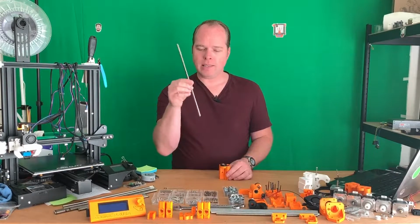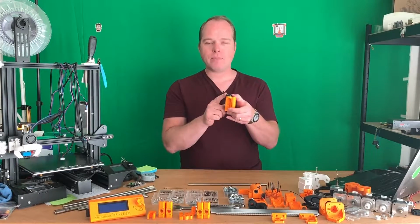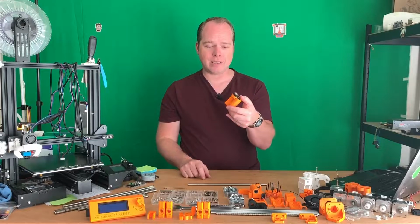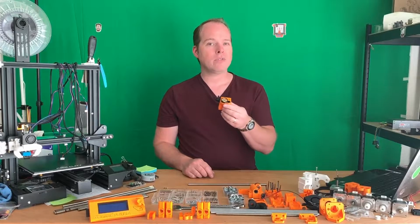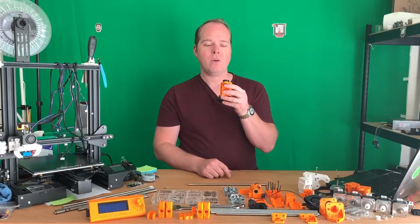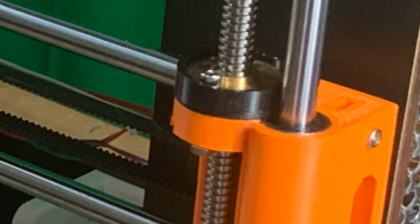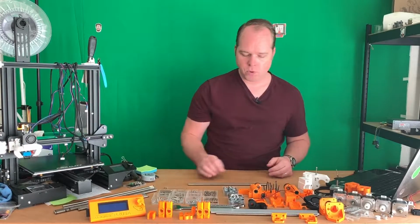For example, these lead screws have a pitch of 2 millimeters. So I had to design an adapter because the lead screw nuts were a little bit tiny and they wiggled all around in the hole and it didn't fit. So what did I do? I went to Fusion 360, took some measurements and started designing it. Well, it's a tight fit and it fits nicely together, just like it should. I pre-assembled this part and also the other one. I hope you don't mind.